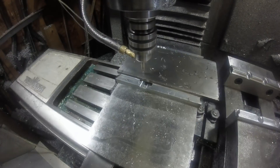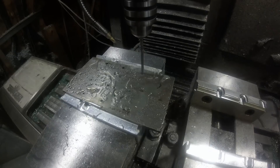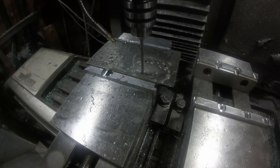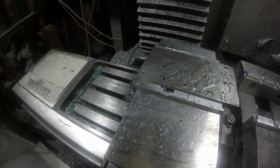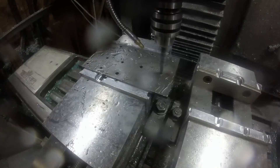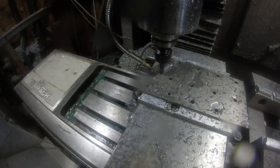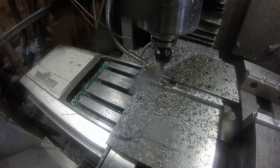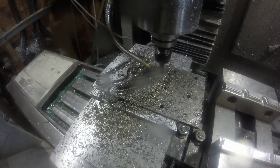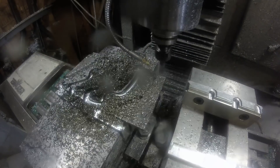So the next piece — this is going to be the body. This is a piece of quarter-inch cold rolled in the mill. I'm only cutting part way through here because I want to chamfer the edge of all these pieces. I've found that if you get rid of some of the excess material before you chamfer, the tool will last longer — at least that's been my experience.